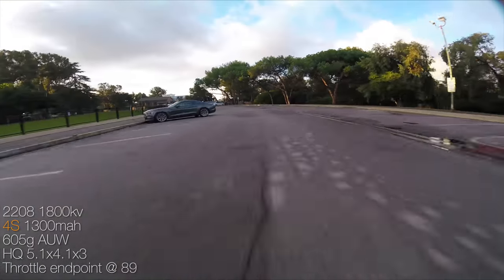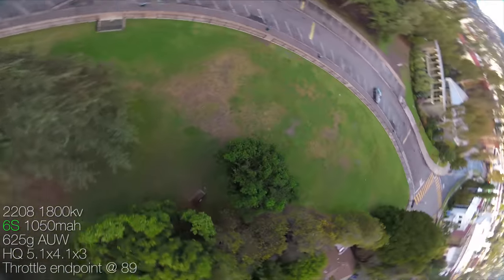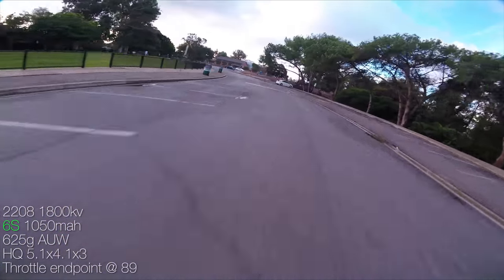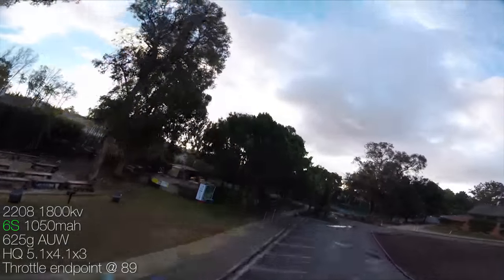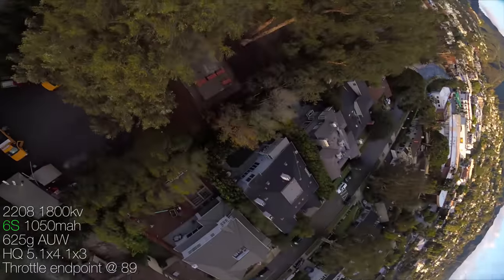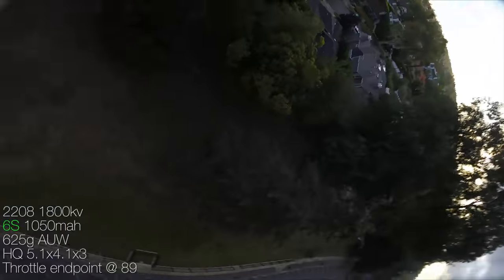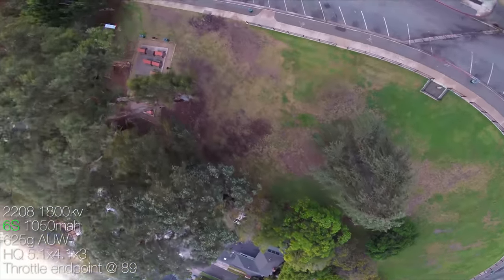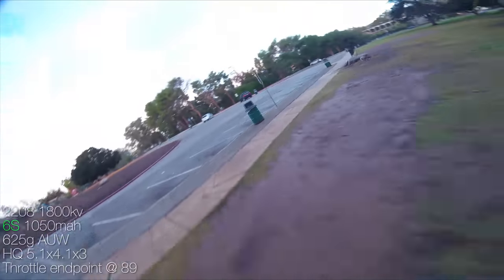The main reason is that 4S quads typically have problems managing their battery. They draw a lot of amps and the battery can't dish out amps the way we want, as fast or as often as we want. That's the real benefit when you move to 6S. So any quad built from here forward, I personally think it should be built for 6S — you can still fly it on 4S and do probably all the same stuff without destroying batteries.